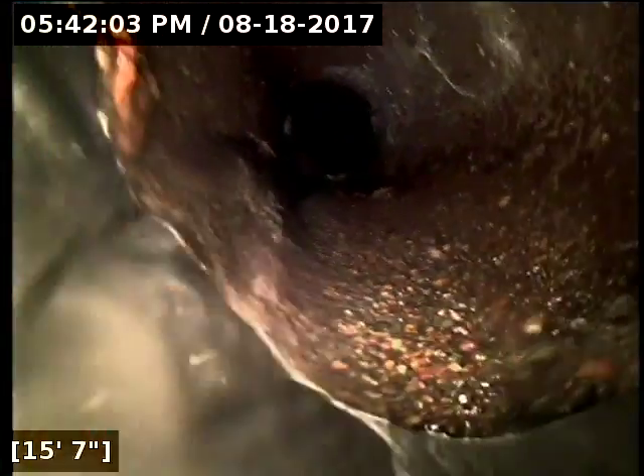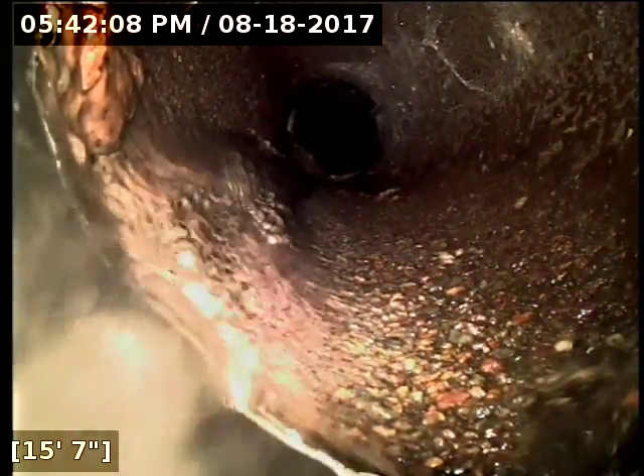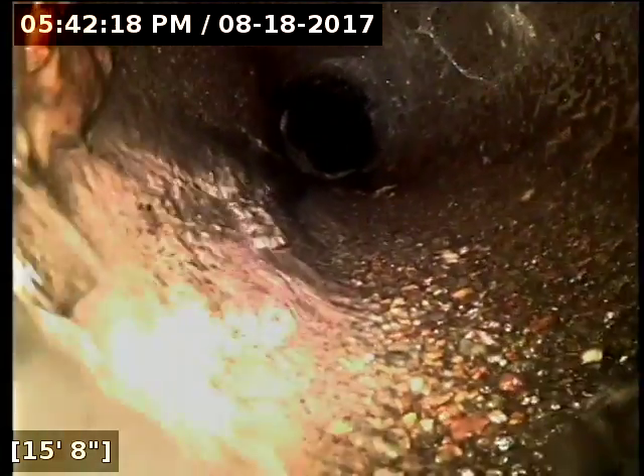It transitions here over to 6-inch concrete pipe at 15 feet. There's a little bit of debris right after the joint, and on the left side of the screen it looks like a little bit of grease buildup. Sometimes at transition joints like this, they are a weak point for roots to get in. There's no trees anywhere in the vicinity of where the line's at, so I highly doubt there's a root stuck underneath that little bit of debris. Roots can get covered up by debris, but I don't see what tree could possibly send roots through there, so I'm really not concerned about that — I just wanted to point it out.